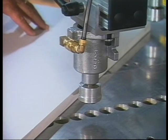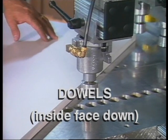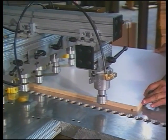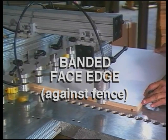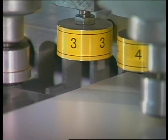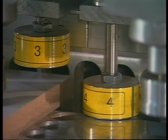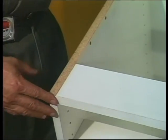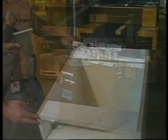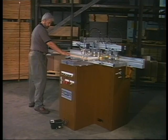Reference the panel's outside face flat against the table for connector screw through boring. For dowels, reference the inside face against the table. Engage stop three. For accuracy and repeatability in vertical drilling, place the edge-banded face edge against the fence. Position the panel and activate the boring cycle. Release stop three, feed through and engage stop four. Position the panel and activate the boring cycle. This process keeps variations in thickness of panels thrust to the inside and to the back of the cabinet.